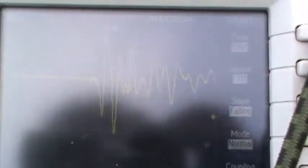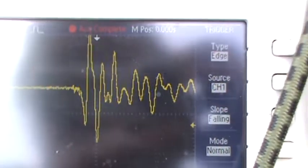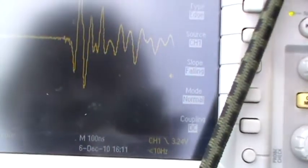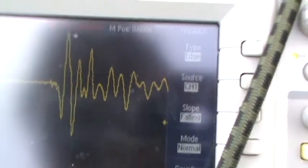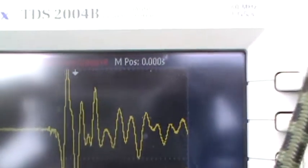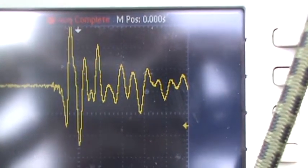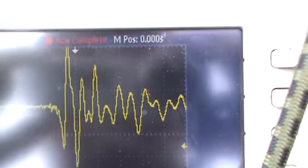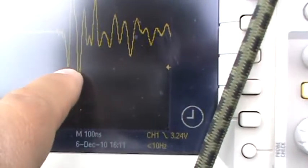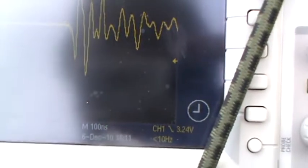Interestingly enough, even before I started the experiment, the voltage trigger on the oscilloscope has already been triggered. I'm going to go ahead and capture this noise here. You can see that the noise is quite large. The unit interval of time on the x-axis is currently set to 100 nanoseconds, and you can see that this lasts about 1, 2, 3, 4, 5, 6 — at least 600 nanoseconds.